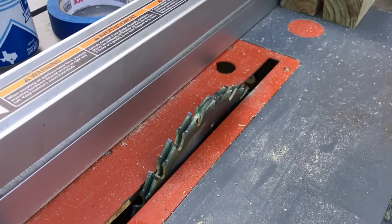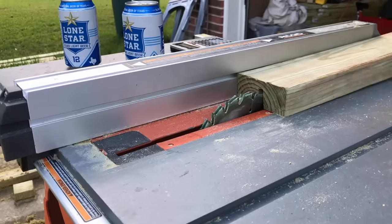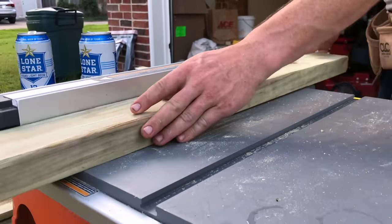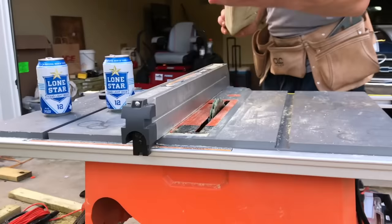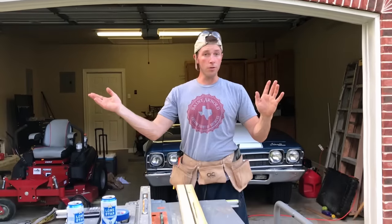So basically, you take a saw table set up for a dado. This one actually will do 3/8, which is what's required. And you just slide it over and it cuts the groove going through. And then basically, you have a modular unit. You can do it 8 feet, 10 feet, however long you want your dado, however long you want your fence.